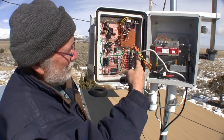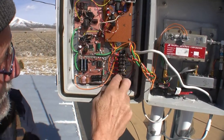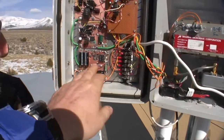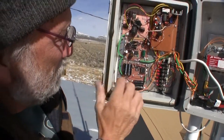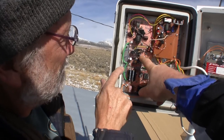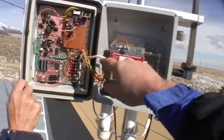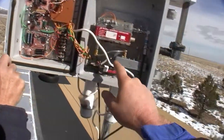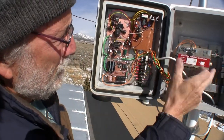We have a big control cable that comes in from the ham shack — a lot of wires on it. AC comes in here, about 20-30 volts. This provides plus and minus 25 volts. This takes the negative 25-28 volts and knocks it down to minus 20 volts for these components, and this takes the plus 20 volts and knocks it down to 8 volts for this, which runs that.